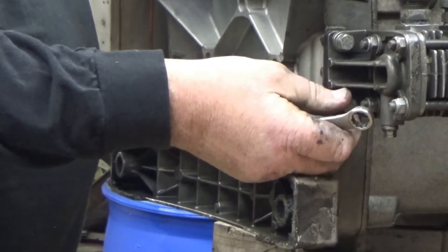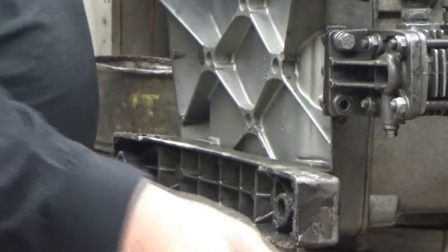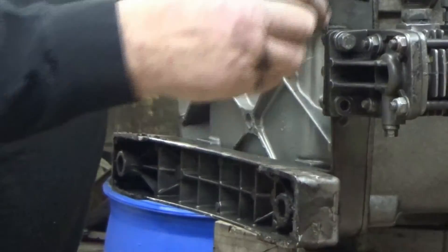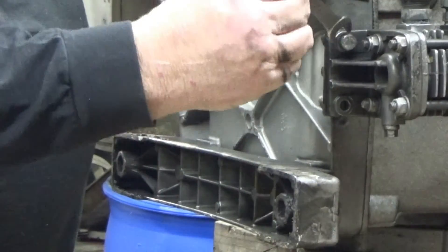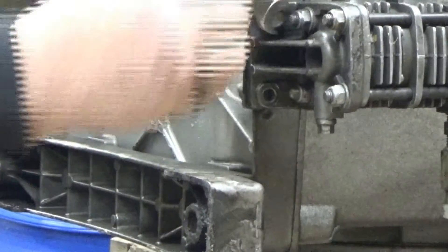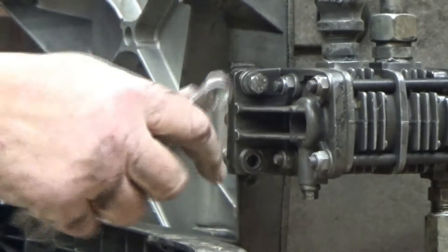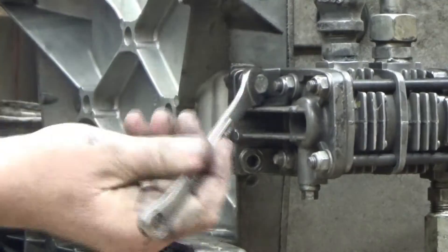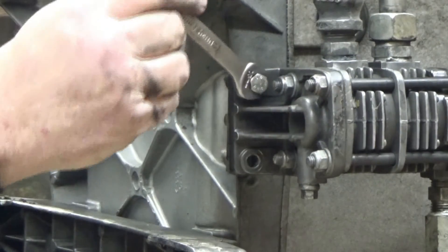The bottom of this all comes apart. This really wasn't a V-twin — it was a V-single whenever you got it. It almost turned into a pistonless. We're going to take this loose and just let it hang there for now. This machine is a $9,000 pump, and after looking at the crankshaft, I'm not sure the crankshaft will be saved. The other connecting rod has a mark on it. I don't want to change the other connecting rod if we don't have to. We're trying to fix this as cheaply as possible for the customer, but I don't want to fix it so it runs five minutes, he sells it, and it blows up down the road. We'll talk more about the economics after we do a parts lesson.